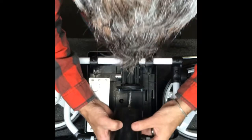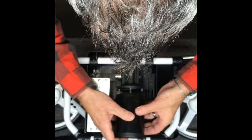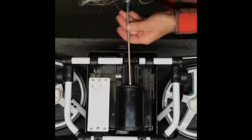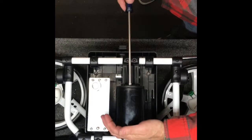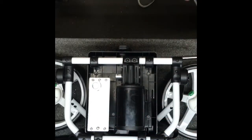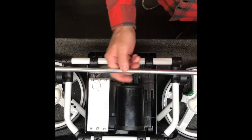We will reinstall the motor. Just grab the motor, and if it looks a little dry you can put some grease on there — just a little all-purpose grease. There are three holes; you want to make sure the center one is at the top, and it just goes in there. You might need to turn it a little bit. Once all three screws are in, do those hand tight — don't over-tighten them, but get it nice and snug.